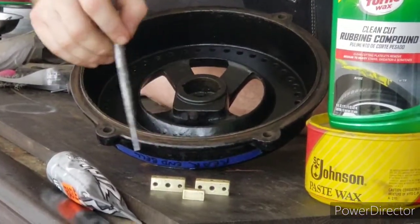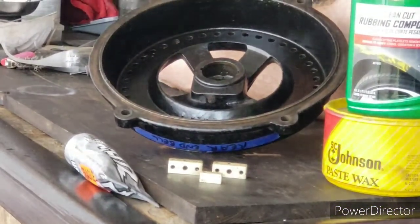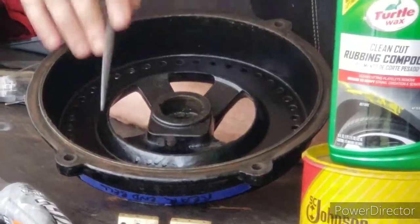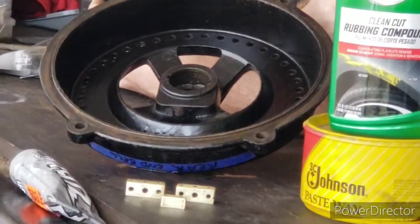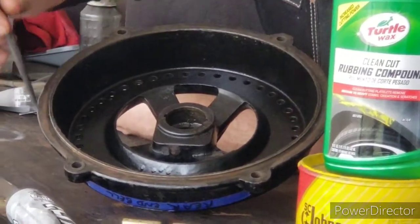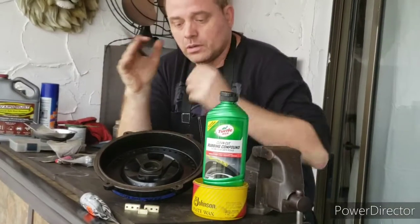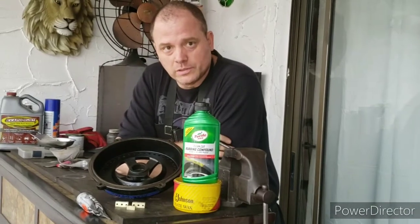The brass terminal blocks here, I've cleaned these and I've removed about 50% of the defects in there. I didn't want to take them down to a brand new surface. I just want them to look used but well preserved. So I just cleaned them up, took about 50% of the defects out of there, so you can still see a little bit of the patina in there, and didn't make them look brand new. Also, these mating surfaces here, I need to make sure that those are clean. If there's any grit or anything like that in there, you could have a situation where the shaft is sitting cockeyed in there. So we don't want that. So I'm going to do all of this by hand.